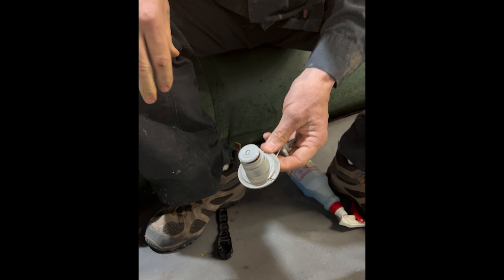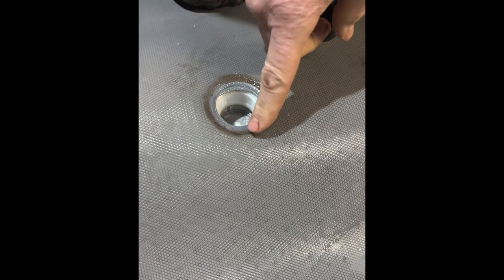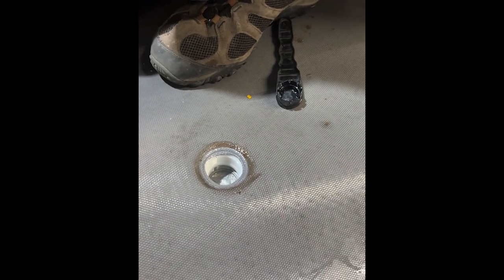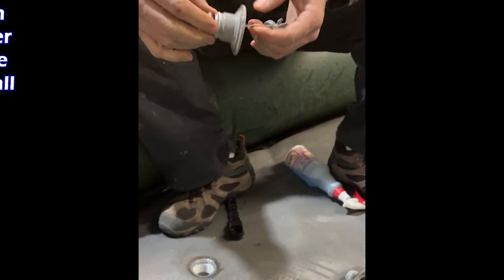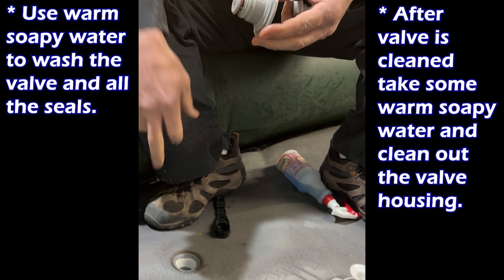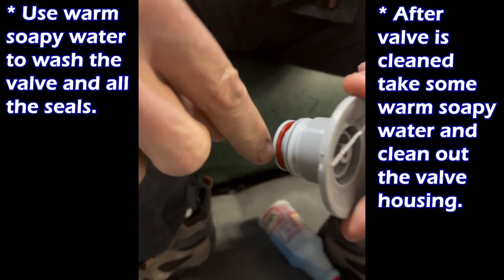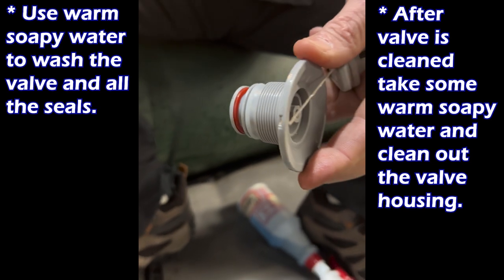This valve kind of surprises me — it doesn't look too bad, but there's a little bit of dirt there and some dirt down here. I can feel it on my finger; it's just grit, and this is probably what's keeping us from getting a good seal. So we're going to take this valve to the kitchen sink, get some warm soapy water, and clean it really well. We'll come back with soapy water and clean out the raft opening too, and while we're at it, clean the o-ring gasket at the bottom even though it wasn't leaking — since it's apart, we might as well clean it.